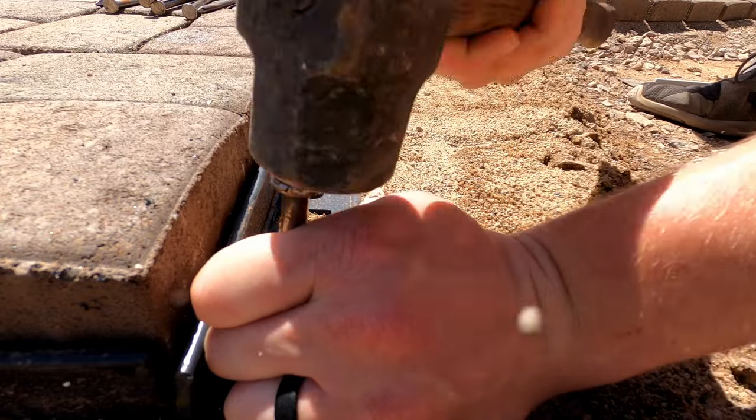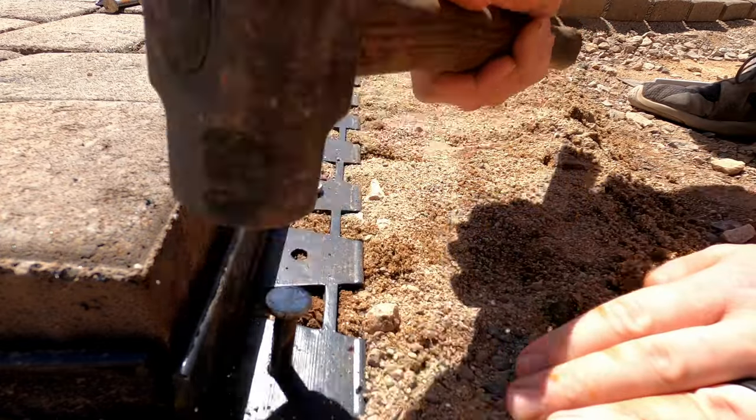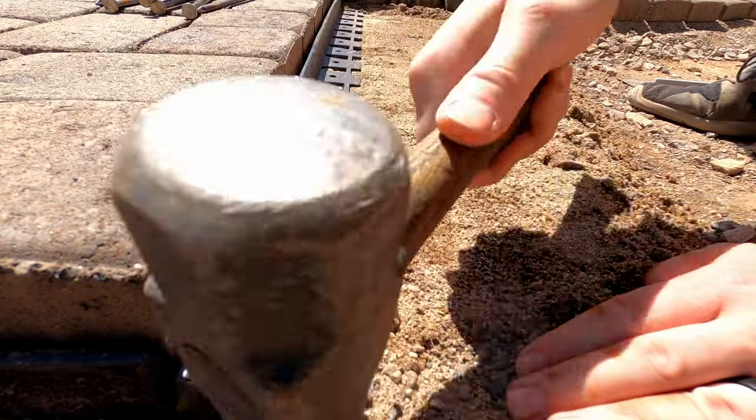These spikes are almost three-eighths of an inch in diameter steel, so it's going to take a very long time. You have decades before these spikes actually rust into nothing, and in that time as they rust, that rust locks in with the soil and holds them even tighter than just a smooth spike would. So don't use nylon — make sure you're using bare steel spikes.